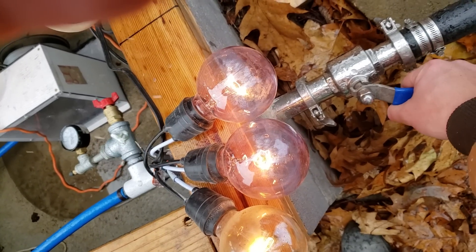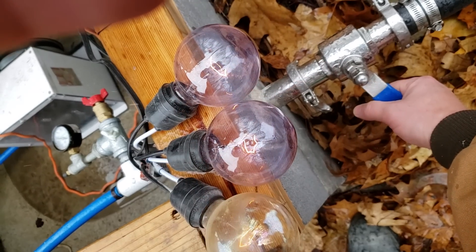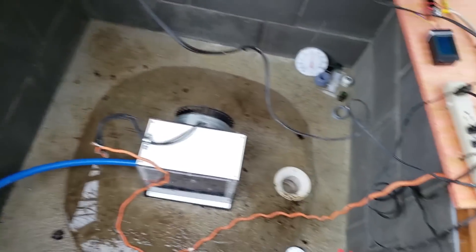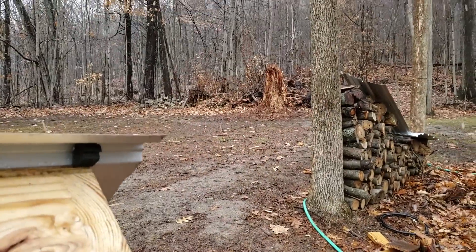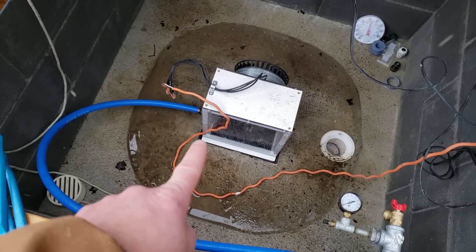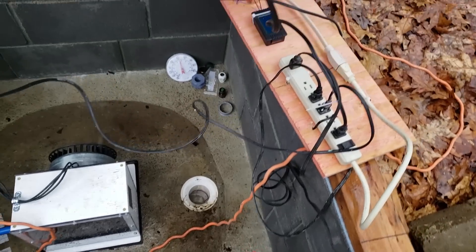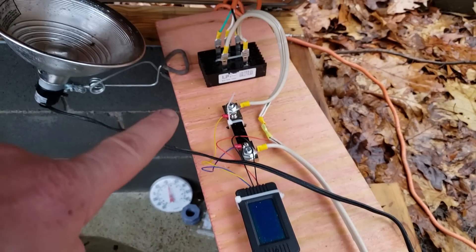It's many days later and we've had some weather — it's currently snowing. The spring is outputting at least 11 gallons per minute. I have a jet on there rated for 11 gallons per minute, and it was maintaining full pressure as the jet ran unrestricted for many hours on end. So I wired up this shunt and amp/volt/watt meter in line with the DC side of my rectifier.